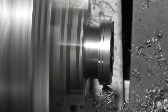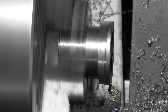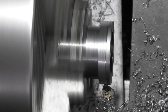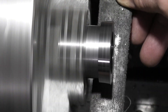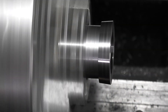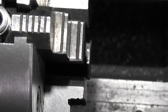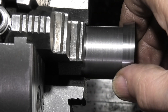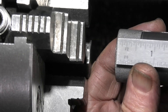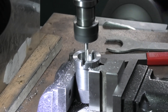I'm just machining a five degree taper. The reason I changed to a four jaw chuck is this chuck has a bigger hole in the middle, so I could put it further back in the chuck — with the other one it would be sticking out and gripping the knurl. It should be two inches. I could turn a bit off the end here. We now mill a five millimeter slot in the end.